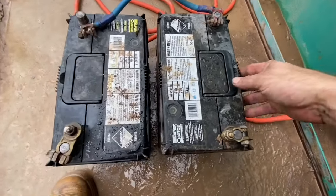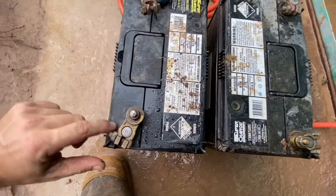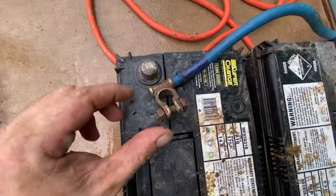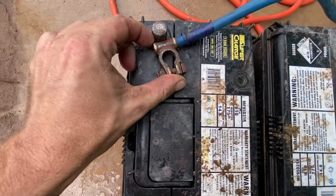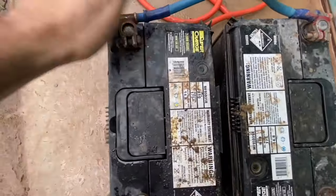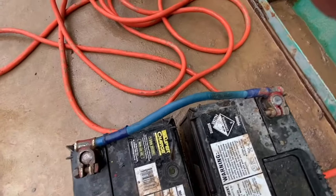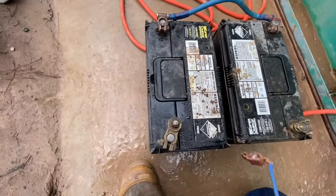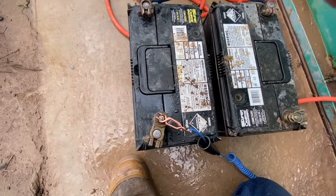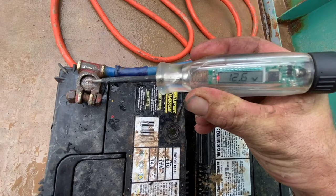So this is how I would do it if that one battery wasn't enough to get it going. I've got two 12 volt batteries here — I put a terminal on each pole and I've got this jumper cable that you can buy from an automotive shop. It allows us to jump the batteries in series to create 24 volts. Having two batteries to jump start machines like this is really handy, especially for machines stuck in a spot where you can't get a car or another machine to jump off.